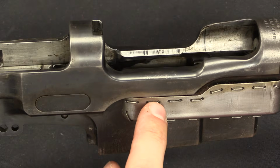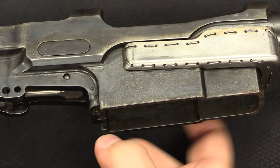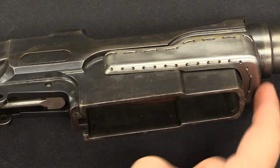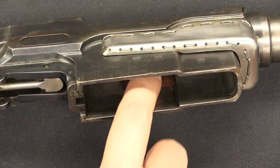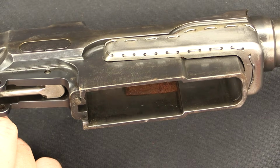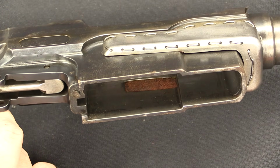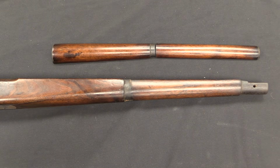This wire is basically stitching a big felt pad inside this sheet metal case. I think the idea there is you can soak up a lot of oil in this pad, which means you only have to fill it with oil once, and then you can shoot it for quite some time. Think of it like a Zippo lighter. You're only accessing the fluid from the top, but that big reservoir wicks up and can continue to be used for a long time.